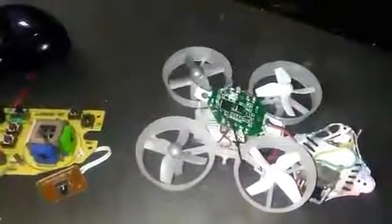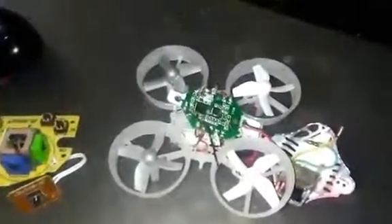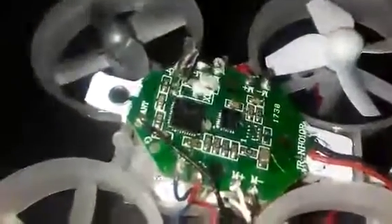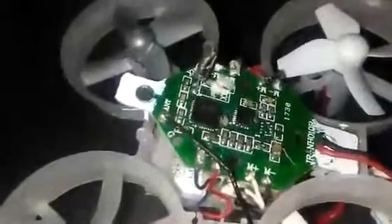My H36 quit binding with the controller. I've looked it over and narrowed it down — there is a broken wire on the crystal right there. But I found another one right inside the controller, the same one. It's going to all match up perfect so that I keep my same binding protocol on my FlySky.